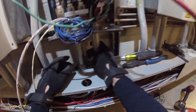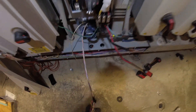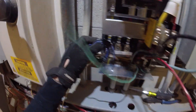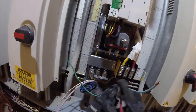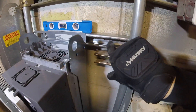We had to drill out our knockouts so we can fit the new VFD. We have two bolts mounted on the side. Our partner is going to come back and we're going to add a Kindorf in the back to support the top. Basically we have everything labeled here — everything goes number for number. This is a three-phase 208 system — three wires going here, three wires going here — and we're just going to match everything up. We mounted a Kindorf in the back and we're going to support that to the concrete.